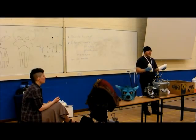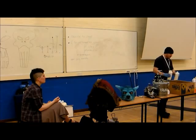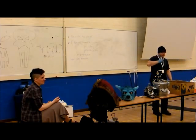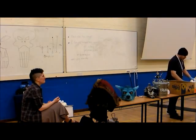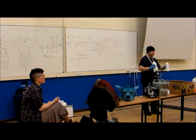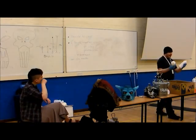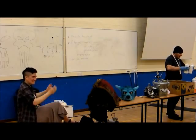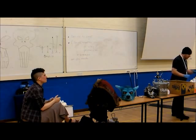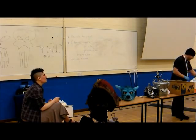Polyurethane resin needs agitating. Don't shake your polyurethane resin, because you'll just fill it with bubbles. When you're agitating, use a gentle rocking action, circular motion, gentle rocking action. All of the chemicals will remix in the bottles and you will actually get a nice white plastic rather than a gungy yellow plastic and rubbish in the bottom of your bottle after 6 months.